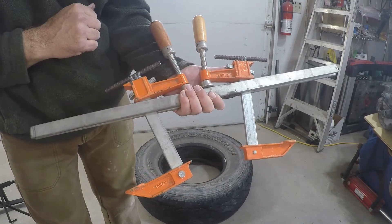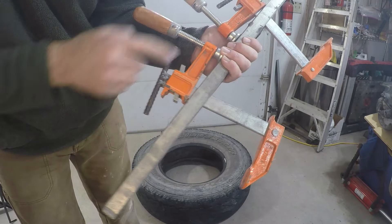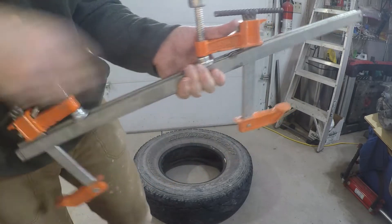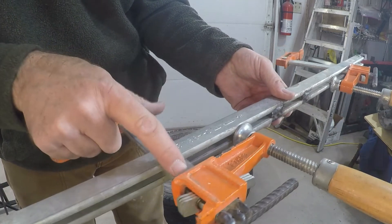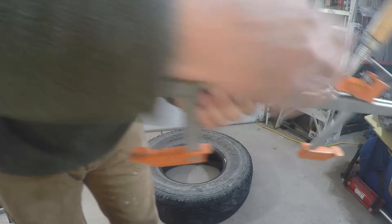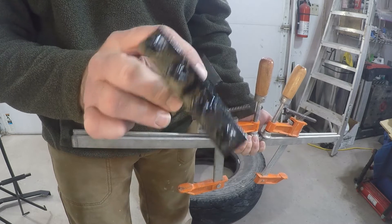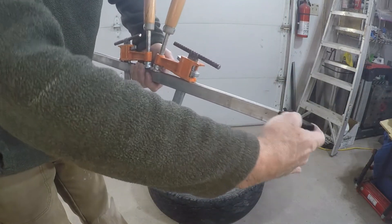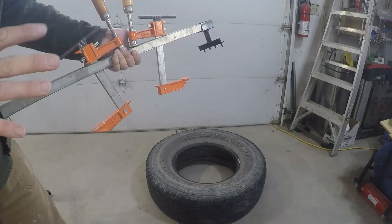This alternative design is going to be a little cheaper — it's just two bar clamps. You can see I cut the length of the bar right there and used extensions of the bar clamps. I welded two little pieces of metal here about the same thickness just to keep them apart the right distance so that these slide up and down easily. Thanks to JD's design, I welded these up — they're just a little piece with some teeth that I can slide on right here on each end. Let's go ahead and time this one as well and see how much height we get out of it.